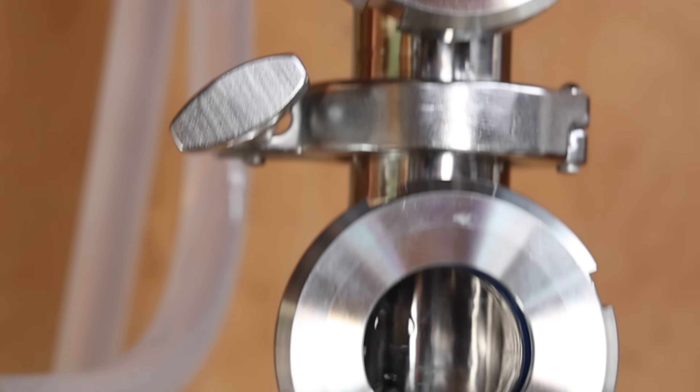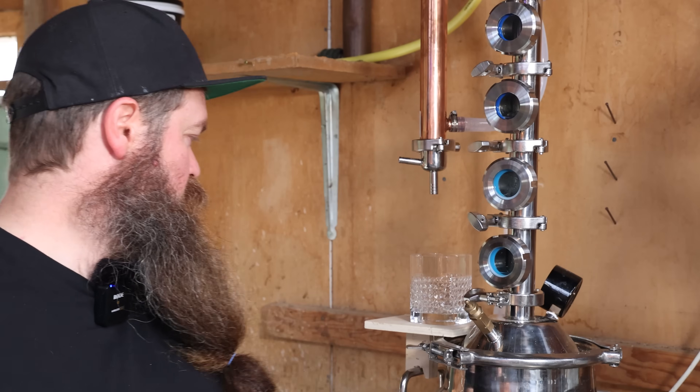The plan now is to give this another minute or two to make sure it's actually balanced and to let it stack and fractionate. Then I'll start dropping the amount of water going into the condenser slowly until we get to the point where vapour starts coming over the top and going through the product condenser. We've been in full reflux for five minutes and the plates have stayed nicely balanced. First drips are coming out of the still.